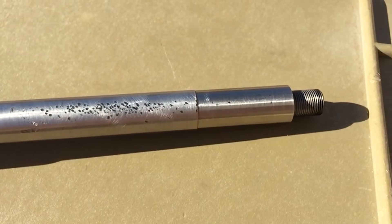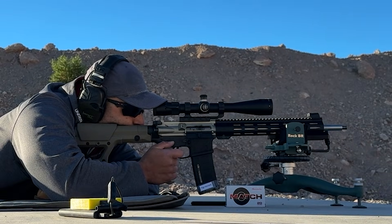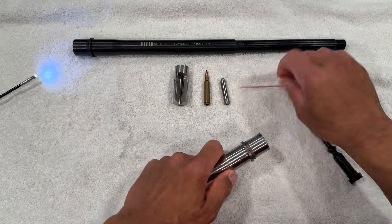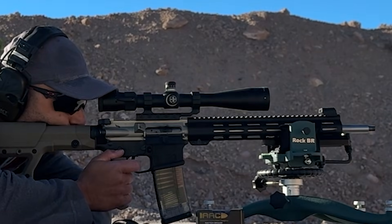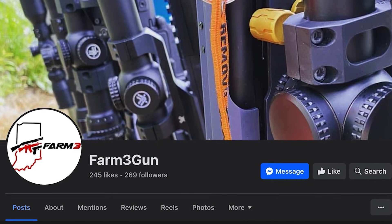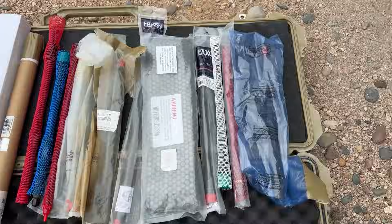All in all, I thought this was a pretty interesting one. We had the failed chamber function gauge, but it functioned just fine during shooting and the owner said he never had an issue with it — so failing the gauge does not guarantee problems, but I would generally prefer the barrel not failing the gauge. We also had the oversized gas block journal, which caused a bit of an issue fitting the gas block, but I was able to work through it. Performance was pretty good, earning second spot on the leaderboard. There was some forward ejecting brass, but recoil and bolt velocity felt fine, so I don't really consider that to be an issue. Thanks again to Aiden Hall of Farm 3-Gun for loaning the barrel. I have a lot more content coming for this AR-15 barrel series, so make sure you're subscribed.